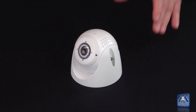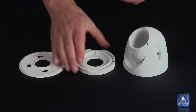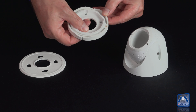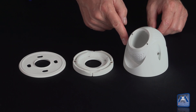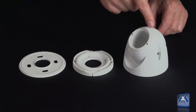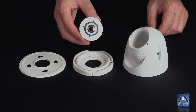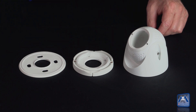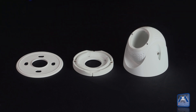The new Pentilt mount is basically comprising of three components: mounting plate with rotation ring, base with ball housing and round inset. All optical sensor modules with lenses L12 to L160 are fitting into the inset. In addition, a rubber seal for a proper and close mounting is coming with the delivery set.